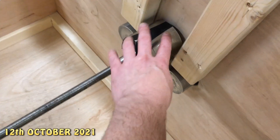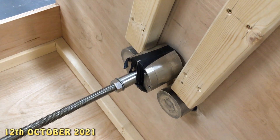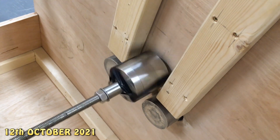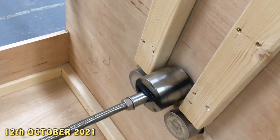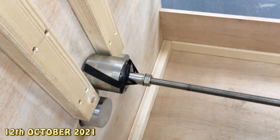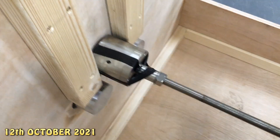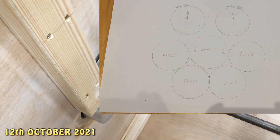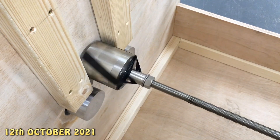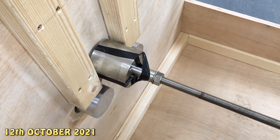I don't think at the moment we're going to need to double up these. A fully adjustable design that can surround this so it's not got any way of bouncing around. With a horizontal permanent magnetic bearing, any magnets that are above don't need to be as close as the ones at the bottom, because of the weight of the rotor. But if it's a vertical magnetic bearing, then you want them all in as close as possible with no contact.